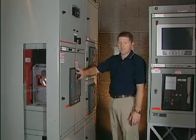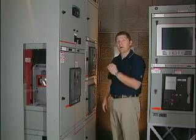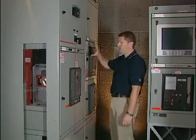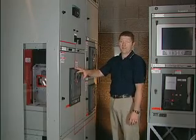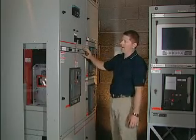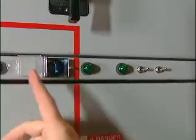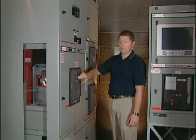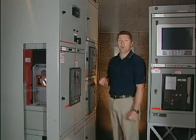The trip unit has more curves than basically any of the competition for selective coordination while maintaining arc flash safety. You can set your instantaneous pickup at a level that allows you to maintain selective coordination with your entire switchgear feed while also maintaining the best reduced energy let-through or arc flash safety. We also have a new feature in the switchgear control panel called RELT — reduced energy let-through. You can turn this on; if you're a maintenance operator and you come to the switchgear and turn it on, it pulls the trip unit into reduced energy let-through mode, setting it to its fastest setting so you're in the best possible arc flash safety mode.